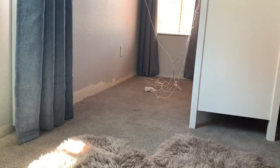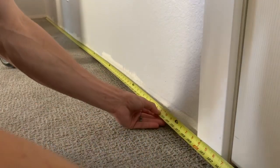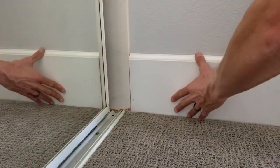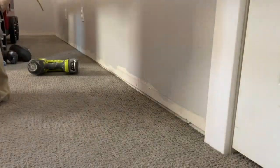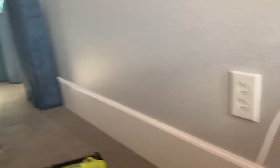When I do the inside walls, I want to make as many straight cuts as I can and the least amount of coped pieces. I'll do the left and the right walls here with straight cuts and then cope that back wall in. For these pieces, you just put your tape measure down against the end of the wall, mark where it's going to go before the door casing, and do the same on the other side, making zero degree cuts. Bring those two pieces back in, fit them, push them down against the carpet when you nail so there's no gaps on the bottom, and nail those two pieces off.